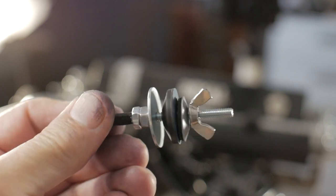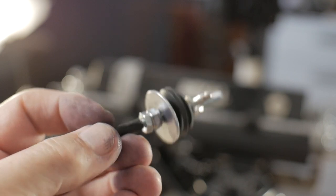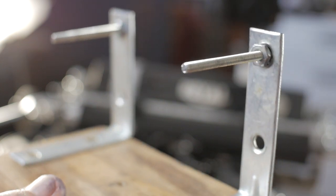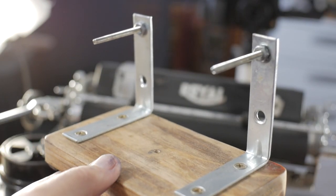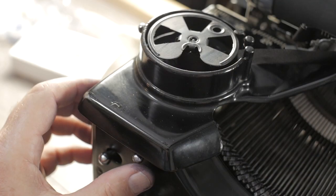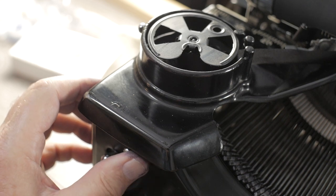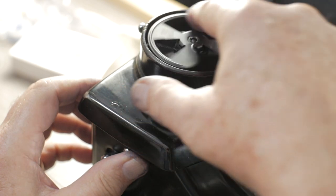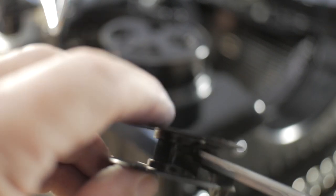As for your technique for winding ribbons and transferring them from one spool to another, I like Bob Marshall's Speedy Spooler, available through Typewriter Muse, or you can make your own homemade version. This version uses two axles so you can spin both by hand, or chuck them into a drill to make it quicker. The third method is to use the unlocking lever for the ribbon advance and turn it by hand on the machine itself. If you want to save the plastic spools and reuse them, make sure you cut the ribbon at the hook — don't try to pull it off the hook or you'll break the plastic hook.